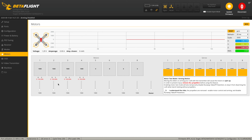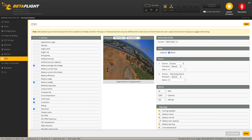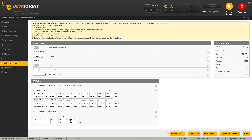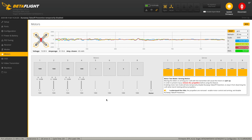Checking motors to make sure we're not getting any errors when we plug those in. OSD — what's it by default? Oh, that's a bit of a mess — a bit too crowded down here. I'll be sorting that out a little bit. The VTX is sorted out here — I don't think it goes up to 600 but we'll see what it does go up to, and the rest of it looks fairly sensible. Just plugging in a battery to make sure we've got no errors with bi-directional D-shot. That looks pretty sensible. Oh, there's that beeper — didn't like being unplugged. Anyway, that looks fairly good. I'll set it up to my liking and we can finally take it out for a fly.